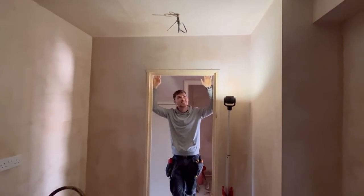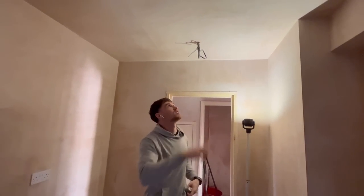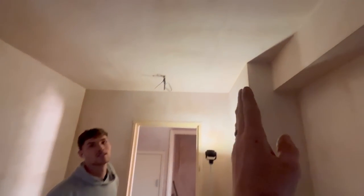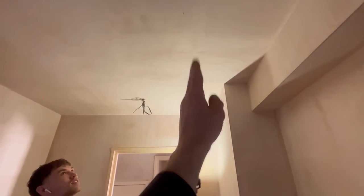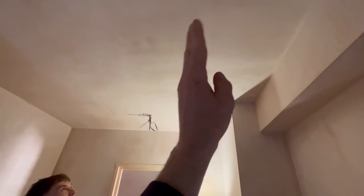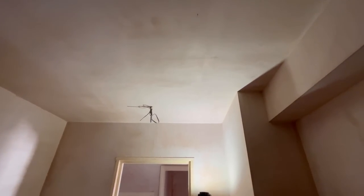Should we have a look at that, John? Let's have a go. Should be fine, because the joist was drilled at 700, I remember. We drilled at 700 on setting out your joist, so because we drilled it at 700, I know my cable's at 700 and the hole is in line. I haven't drilled it over here, and I've got to try and fish through a hole over there. I know these are all in line for this reason, just in case, you never know. Right, let's have a look.